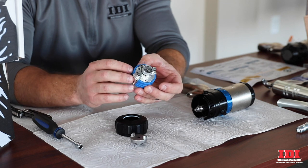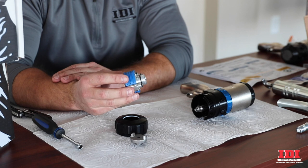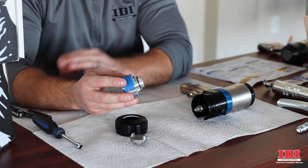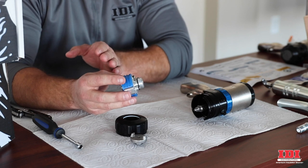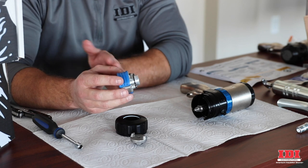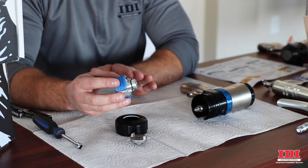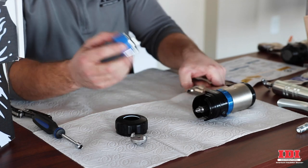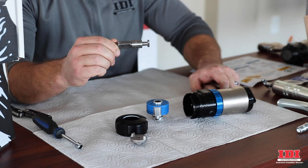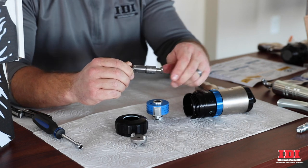The idea with this gun is not that we're going to solve all the world's spray foam gun problems. It's that we want to be able to break it down and fix it and repair it as soon as possible. Reducing downtime on a job site — that is the feature of this gun. If you had gun problems before, you're probably going to have the same gun problems; it's not going to magically fix them. The idea is that we can access the mix chamber in seconds versus before, with all the springs, cartridge assemblies, O-rings, and side seals involved.